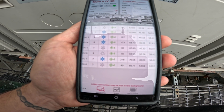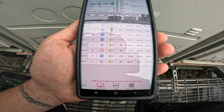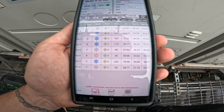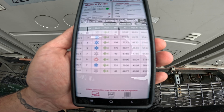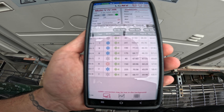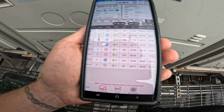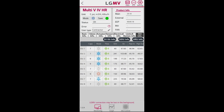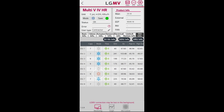You switched it to heat, right? I did, yes. Right there — it went to heat. That's IDU6. That's not it though — we're looking for IDU2. So it went to heat — since I took off the app and reset it, now it shows. Because before I had it locked in while I had the app open. Do me a favor, turn off the thermostat. Let's see if IDU6 responds. Just went off — all right, so 301 is IDU6.